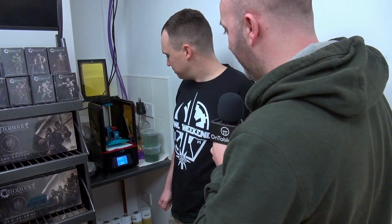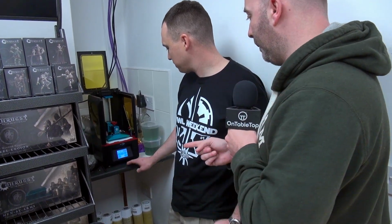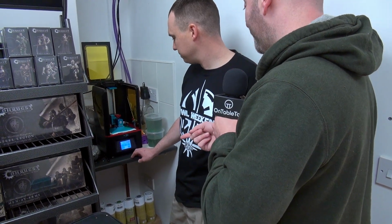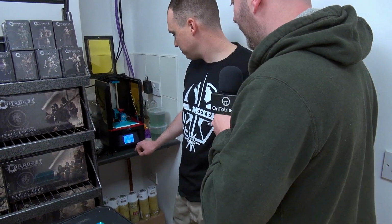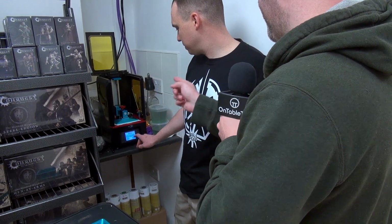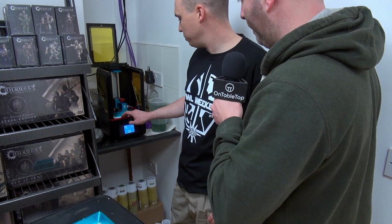So we're just about down to where it should be. So you see the 3 buttons at the top there. You have a 0.1 mil, yep, a 1 mil, and a 10 mil. Yep. Do not touch it with it set to 10 mil right now. I need you to set it to 1 mil. So hit the 1 mil. And then what you're going to do is press down 1. Right, now, try and move that sheet of paper. Yeah. Still pretty loose, right? Yeah, very loose. Put it down another one.